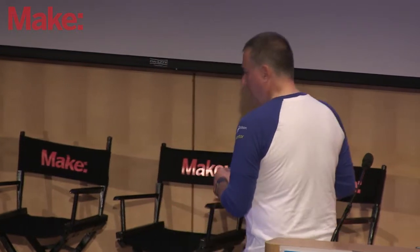So getting back to the maker piece, one of the things that we want to do is make it easy for you to start. Using the databases, the OrCAD schematics, or Eagle schematics, and the Eagle layout libraries, you can get started with your platform right away. And we include things like how the USB connects, so that you can get your console window up and running no problem, or you can get client mode to work correctly, or USB host mode to work correctly. So you can design your own, and then you can go to some of the custom expansion board vendors, and they'll make you a custom expansion board.